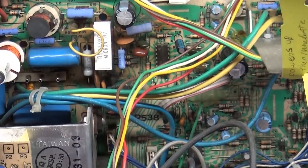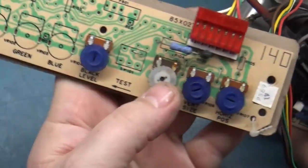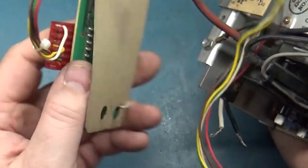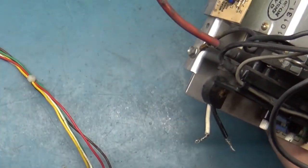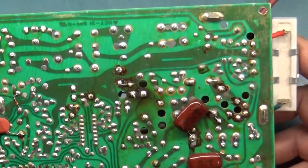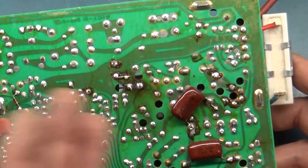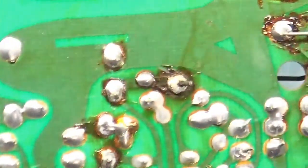Everything on top is complete, but if we look at the back side — it's another one with this different type of remote board. All of the solder joints on this connector are super paper thin and they develop issues all the time, but that's not going to cause shutdown. On the back here, as you've learned from my K7000 videos, R101's pads and joints are toasted.